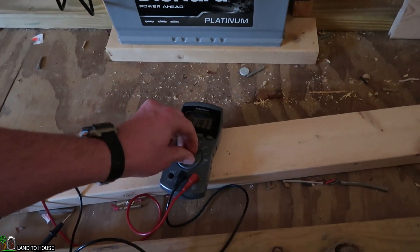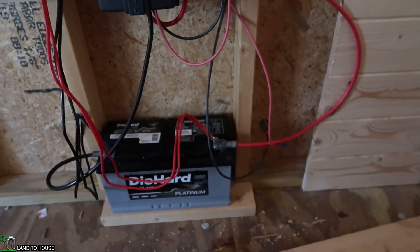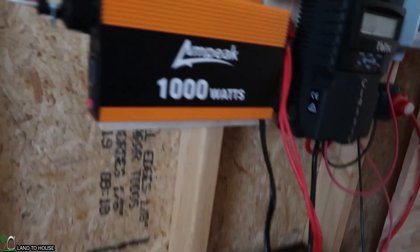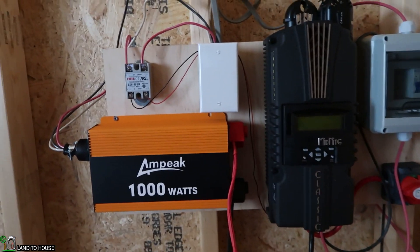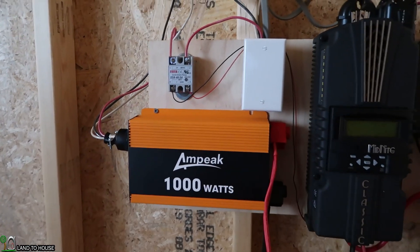We need to pull this out, turn this off, and charge that up at the car I guess. What I'm going to have to do is just make sure I turn off this little switch right over here whenever I'm not going to be using this for a couple of days. We had some pretty serious cold weather and about five inches of snow, and it sat on the panels for days and no power was made, so I just continued to use the battery. Apparently the low battery shutoff is only going to work whenever the unit is pulling power.